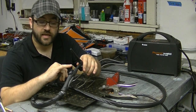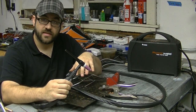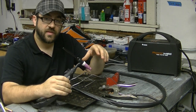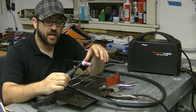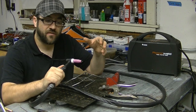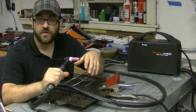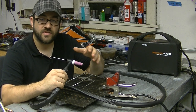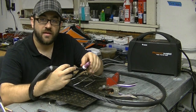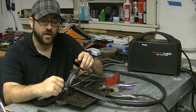All I'm using is the start button. When I'm working on fairly small tube work, I can get into an awkward angle and different positions. With the lift TIG before, I was having to actually touch it and pull it away and try to keep everything at the right distance. The high frequency start of this unit makes things so much easier. However, I still sometimes like to hold the torch in an awkward position, and at that time it can be difficult to press that button.